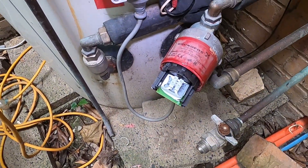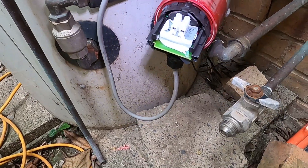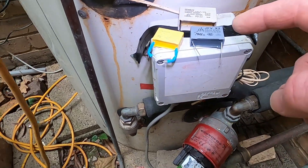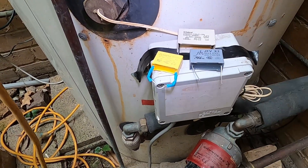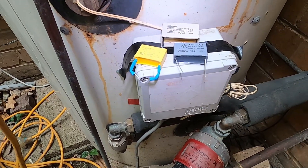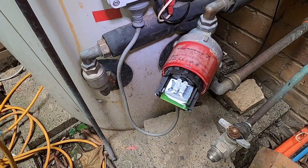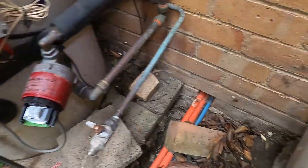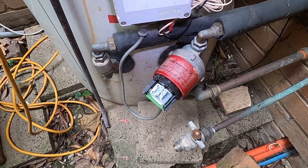Just wrapping up to show how it all worked out. The larger capacitor arrived - this is the correct value, 0.68 microfarads, marked 684. The original was 0.62 and the interim one was the 474. Just to confirm it's all working fine - I'll get it all back together and put the cover back on this time so it looks a bit tidier.